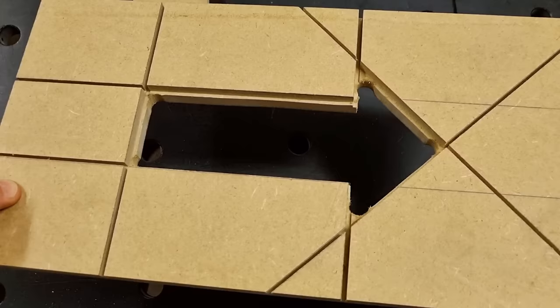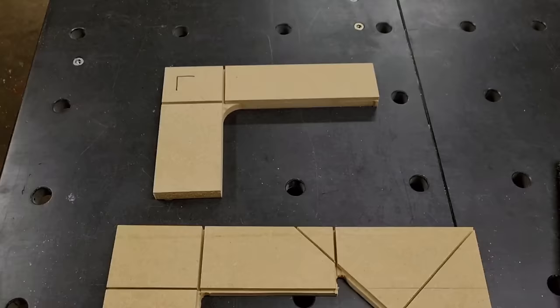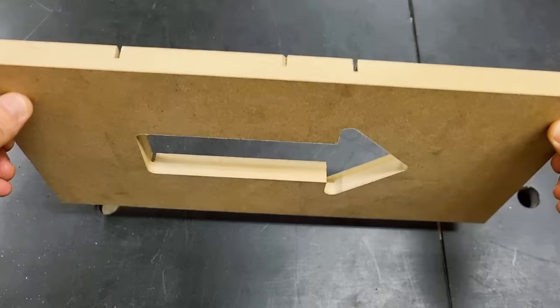Step four is to drill in the corners. In step five I remove most of the waste inside my saw lines — for a closed construction like this, a jigsaw is used for that; for open template constructions I prefer to use the bandsaw instead. In step six I use a bearing-guided router bit on the router table and remove the remaining waste, which makes the template shape complete and ready for routing.